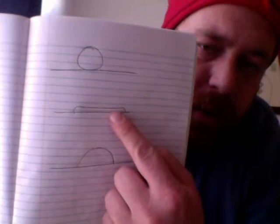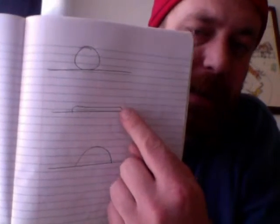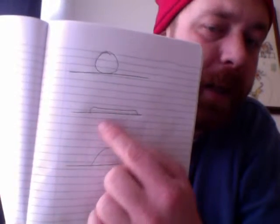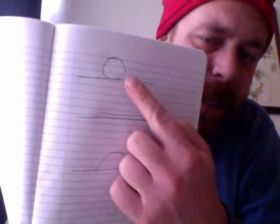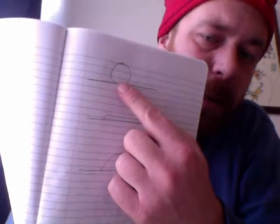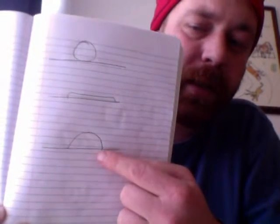This will give you all sorts of problems because you're too close and this first layer is extruding everywhere. It'll look bumpy and lumpy on the sides, and that's no good. If it's coming out super smooth and curling up, this is probably what you have. This is what you want. So anyway, I hope that helps a little bit. If you still can't get it to print smoothly, contact me directly. We will figure it out.